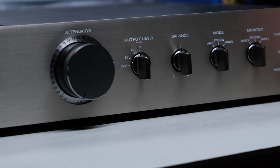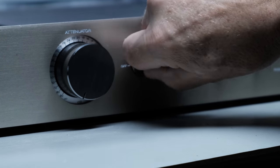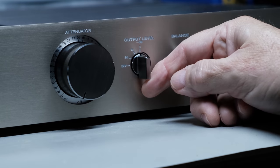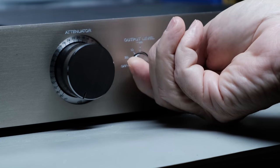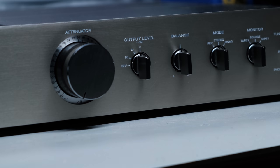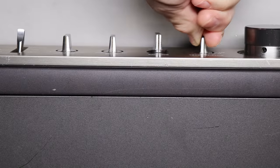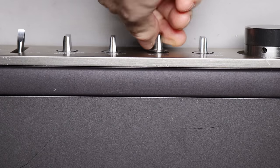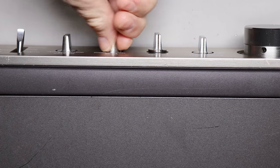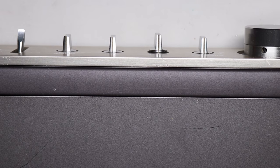Well, it may. Usually, you guys are familiar with these controls that are noisy, and you'll hear static, and you'll lose your channel or lose volume, but you keep playing with it, and it'll come back. This was extremely consistent. When I put it in a certain position, it was always the same defect. It wasn't flaky at all. I put it at 0 dB and I would lose part of my volume in the left channel. I would flip the switch back and forth, thinking it was going to act flaky again, and it didn't. It was always the same way.